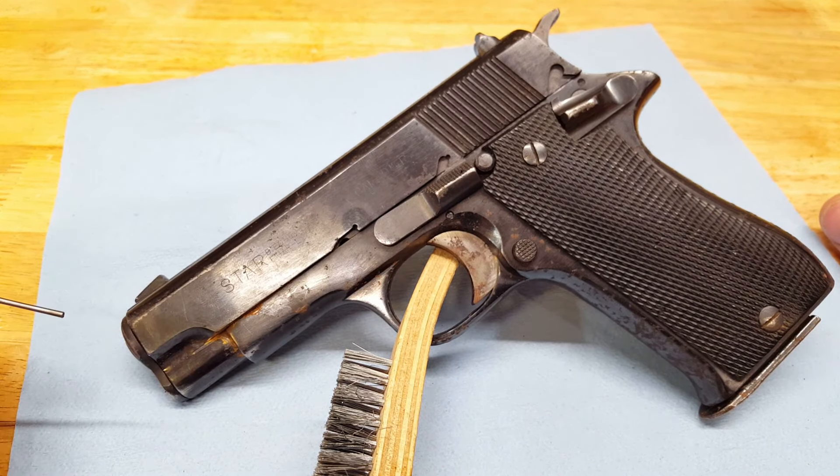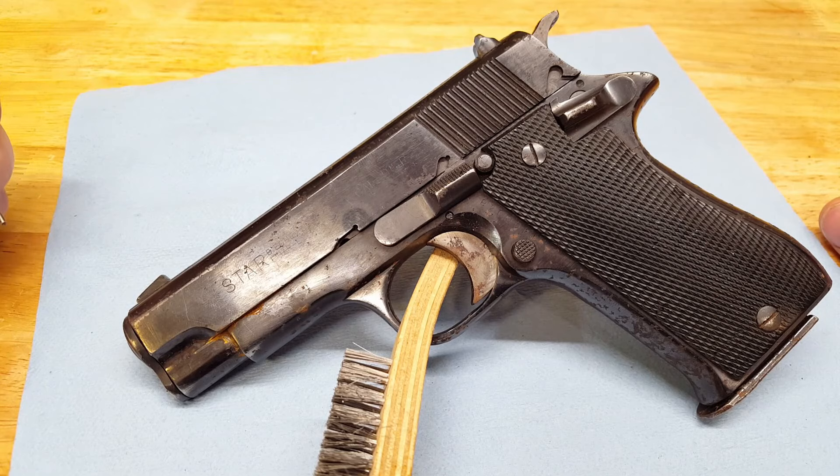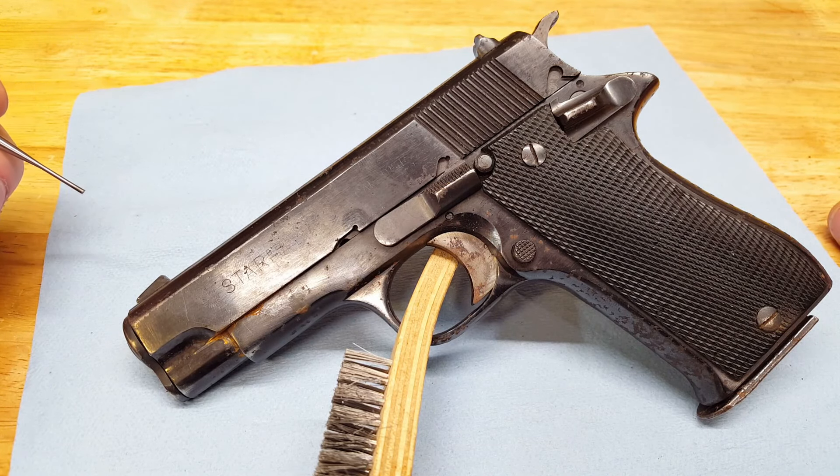But this thing is pretty nasty. It seems to work fine but even all the internals are rusted. So I'm gonna stick this thing in the ultrasonic with some mineral spirits and scrub it down real good with a wire brush, then oil it up and set it aside.